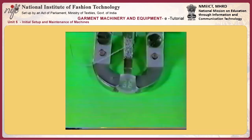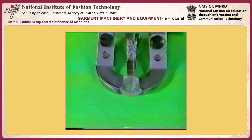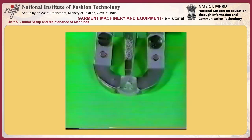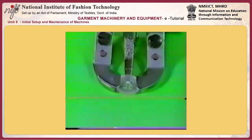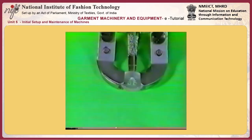When sewing 4-hole buttons, the needle first throws to the right at the start of sewing. The 7th and 8th stitches are tie stitches, and also the 15th and 16th stitches are tie stitches for the holes located on this side as observed by you.